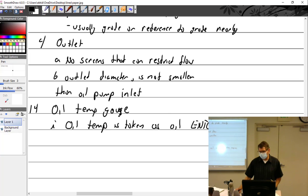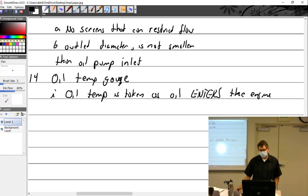And that's an important point, because if I take my oil temp and it's 200 degrees, it is entering the engine. What's the oil going to do from there? It's going to get hotter from there. So you're seeing it at about the coldest point. And I'm guessing when they all got together, maybe they tried it at the other end and thought, no, that's just making pilots poop. We got to cool it down here, so we'll take it where it's cold. Sounds like a good plan.